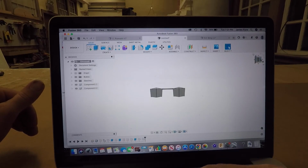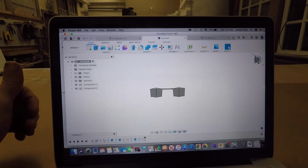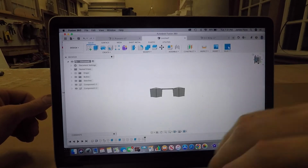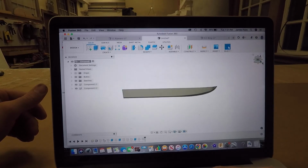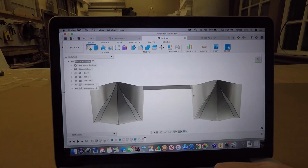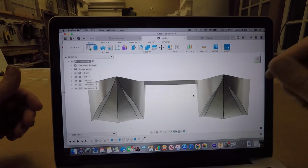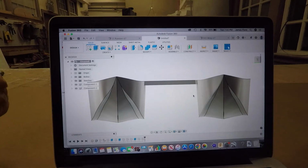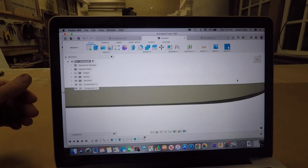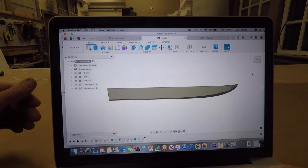So you can see that there, and the shape of the hulls is now tailored to being powered, particularly with like a 5 to 10 horsepower motor. So the idea is definitely motorized, and so on these hulls, I put a bit of a reverse chine in there, and that reverse chine goes all the way up to the bow, and that wasn't there on the first model. So you can see that the fairing isn't perfect yet. Again, I hadn't even gone through and done it yet, but yeah, a nice reverse chine to get all that spray out of there. Some issues with that on the previous 3 or 4 designs. A little bit of a scoop in the bow. I'm not entirely sure how drastic I'm going to have that, or if I'm even going to keep it, but a little bit of a scoop there.